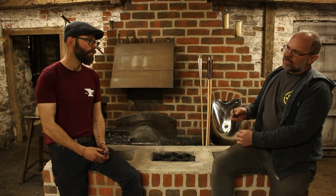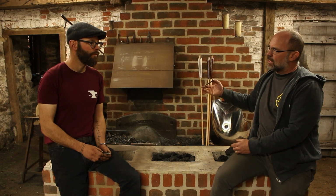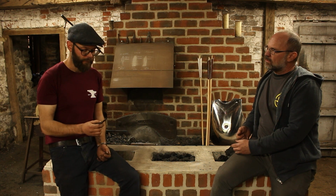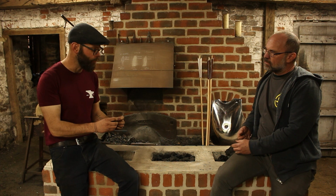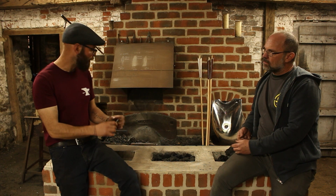Out of interest, do you think that you would have one workshop specialising in bodkins and another workshop specialising in bladed arrowheads? I don't know. And that would be a really interesting thing to find out, because they are very different. Once you've made the socket, you can kind of do whatever you want to the end of it. But if you cut that socket off to weld a blade to it, that's a very different process of turning this round and making a point out of it. And different level of skill. Very different level of skill, yeah.